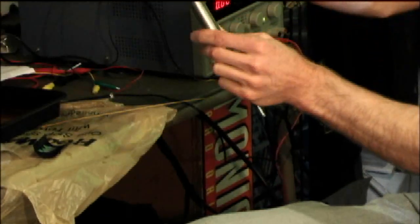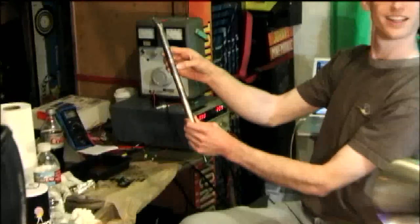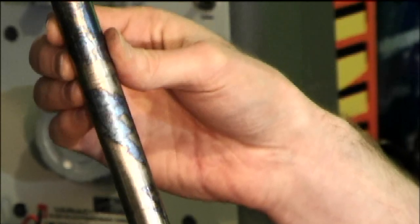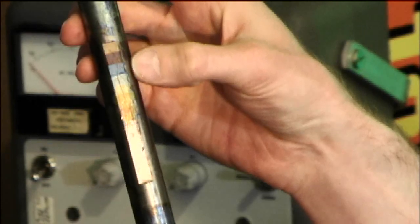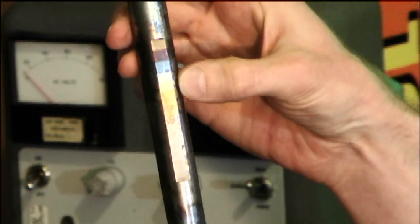I've been playing around — you can see a couple of trials on here. You can see it's a color blue. That blue is caused by the thickness of the oxide and the interference of light reflecting off the titanium surface and the oxide surface. You can actually adjust the color based on the voltage. Right where my thumb is, you can see different colors — that top one is about 10 volts, then 20, 30, 40, 50, 60, 70 volts or so.